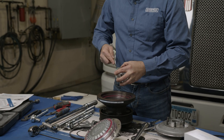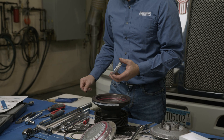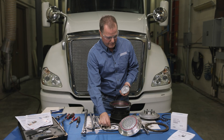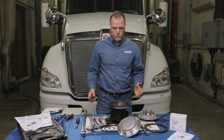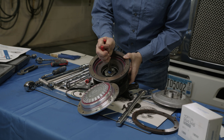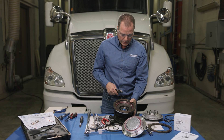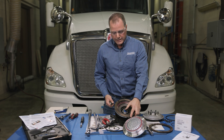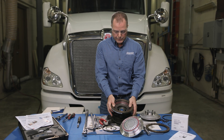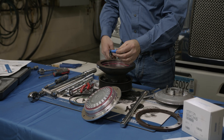Remove the old O-ring seal on the air cap, as you get a new one in the kit. We're also going to replace the face seal. Next, remove the air cartridge by taking out its snap ring. Since we're not reusing the old cartridge, pull it out with channel locks, or you can apply a little air pressure to the back side and hold your finger on top to pop it out — make sure you keep your finger on top because the air cartridge can come shooting out.